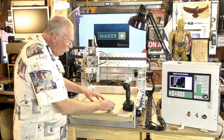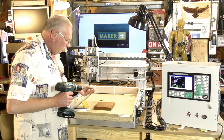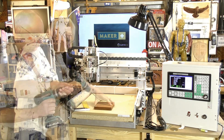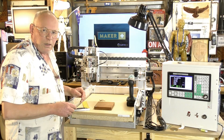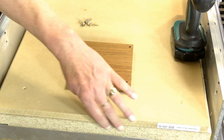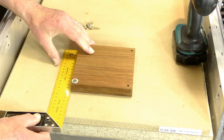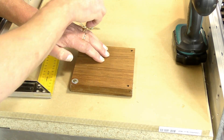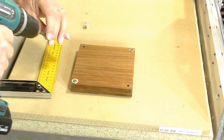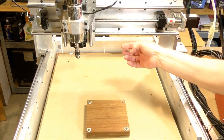The first thing to do is to mount this securely to the waste board — I simply do it with some screws. The first one just goes in roughly like this. Now we need to square it up, so I'll bring you in a bit closer. A simple way is to use a square on this edge, which I know is square to the rest of the machine, to get it roughly square. Okay, very firm.